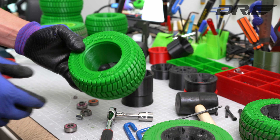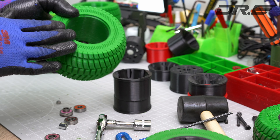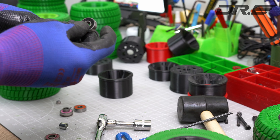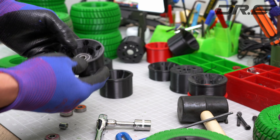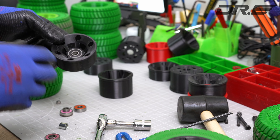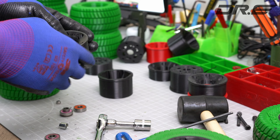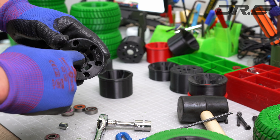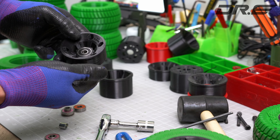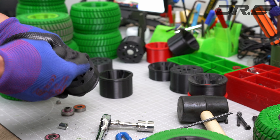Grab one of your TPU tires that you should have printed out. This has a logo on the outside and this is the inside, so you're going to stick the inner in here. Now before you stick it in there, you can go ahead and insert any standard 608 bearings and they should be a snug fit. I printed this out in ABS at 100.5% laterally bigger because of the warping. If you print this in PETG, you can just print it straight at 100% and they should be snug fit. Now if you have a seam on one side and it doesn't fit, just reprint it using random seams — this is designed to fit snug just like that.